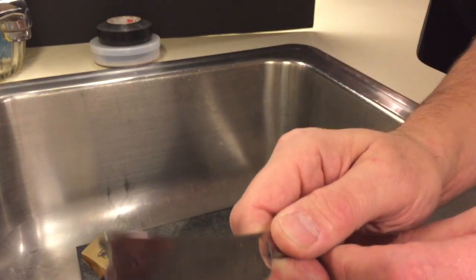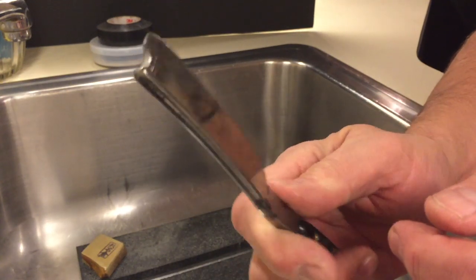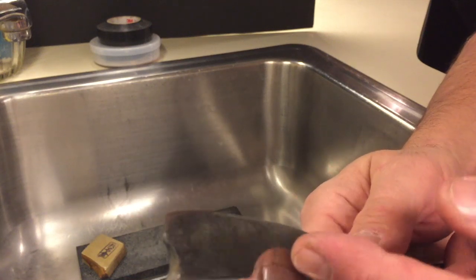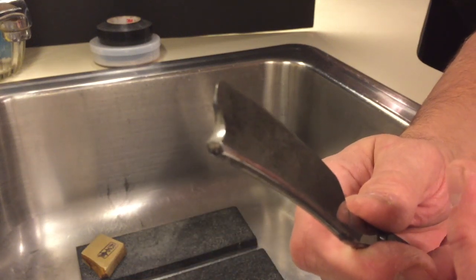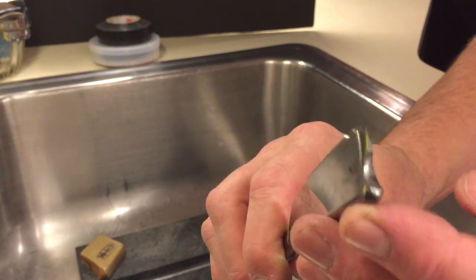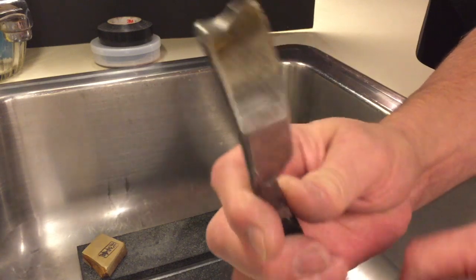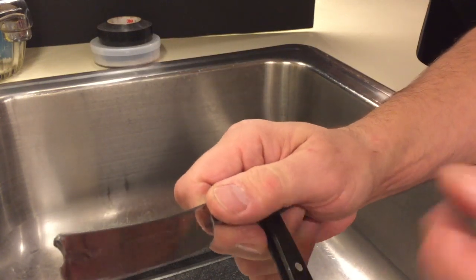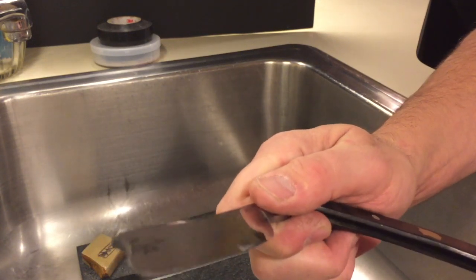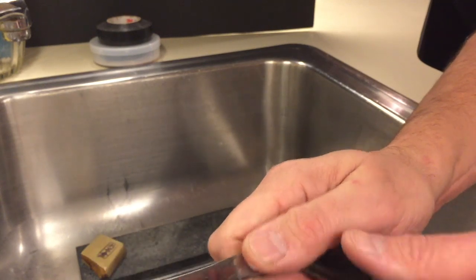All right. And I have to measure this all out. If I put a piece of tape on it, it comes up to a place where I'm comfortable with. It helps me get the blade up off the stone, which actually does help you hone a little bit more efficiently. It leaves the blade looking a little bit nicer, and it saves you a lot of effort because you're not dragging a mile of steel over the stone. You're only putting down what you need up here at the bevel.